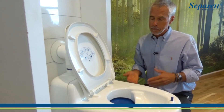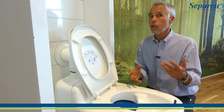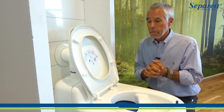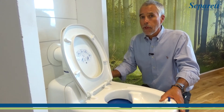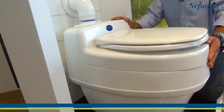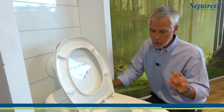Folks will ask about toilet paper — most all toilet paper now will break down in the compost area. If you use heavy four-ply paper, it's going to take that much longer; single or two-ply will break down faster. One thing to keep in mind: things like Soft Scrub have an abrasive in them. This is a polyethylene molded plastic with a beautiful finish — it looks the closest to a porcelain unit in the bathroom. If you use an abrasive cleaner on it, you will mar the finish. So strictly liquid, non-abrasive cleaners — nothing with a cream, paste, etc., because they have abrasives.